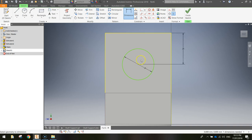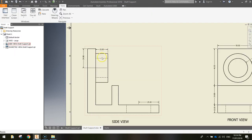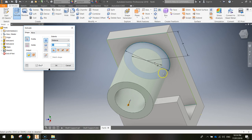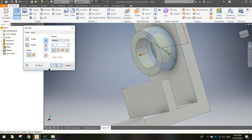With that in place, add the second circle. Grab the circle tool again, click right on that same centre point when your mouse hovers green, drag out, type 36mm for the diameter and press Enter. You've now got two circles. Finish the sketch. Looking at the isometric view, this needs to be extruded 15mm. Click Extrude and click inside the two rings. The distance is currently 50, so change it to 15. Click OK and the shaft support is all done.